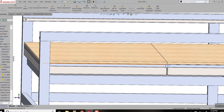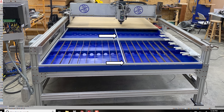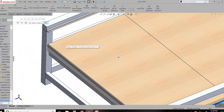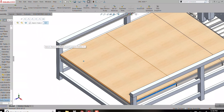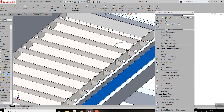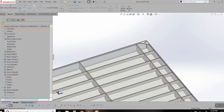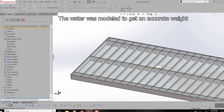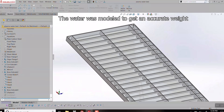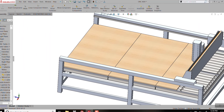I installed these rectangular extruded aluminum frames with tapped holes, and this MDF board will screw down into the rectangular frame. That gives me a relatively lightweight rectangular panel that I can pick up by myself and remove — it'll still be very stiff. The water trays have adjustment screws in the corners: each corner has a hole which allows me to put an adjustment screw as well as a nut. Once I adjust and level the table on top, those will be tightened down and stay in place. Then I can remove the panels whenever I want to do plasma for the full length of the table, or just remove one panel if I only need the plasma in one area — it's very easy to switch back and forth.